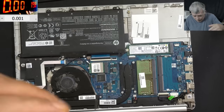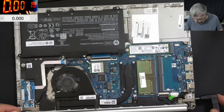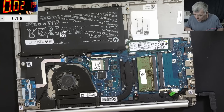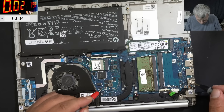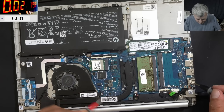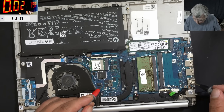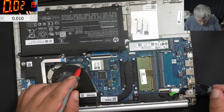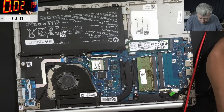Can you spot anything unusual? Let's plug the charger again — it's taking 20 milliamps. Let's check our main power rail. There's no capacitor here. We have coils — most of them no capacitor; they're probably on the other side of the board. Checking here — we have 19.6 volts. So the main power rail is present.